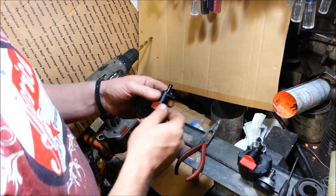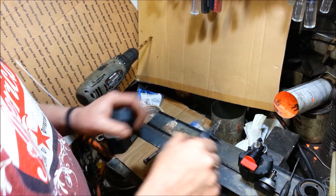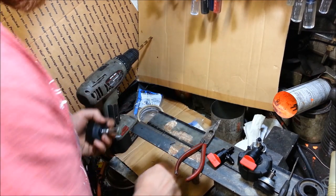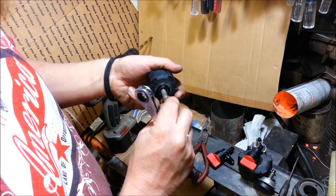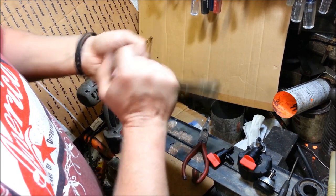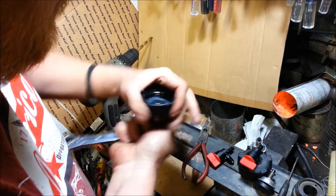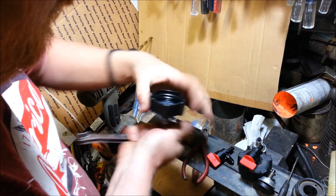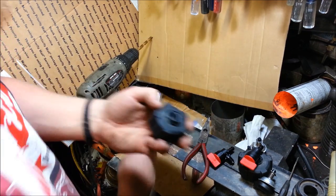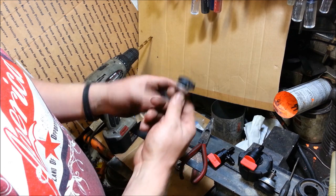Because this is threaded — it's a fine thread, actually like a pipe thread that tapers — it gets a little bit smaller at the bottom and thicker at the top, meant to seal. We need to chase the threads a little bit. I just have a 3/8 fine thread bolt here, and this is going to chase my threads — kind of like a tap. Now I have threads in there, and I can put this right back in and it will seal up and work just fine, just like before.